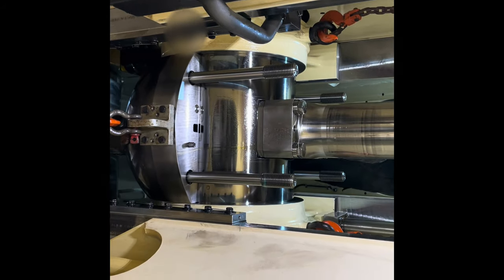Once the pin sits on the bearing, remove the piston and crosshead weight on the two outermost 2-ton chain blocks and loosen the chain blocks. Then apply some oil on the upper part of the bearing and start lowering the crosshead bearing top part using the two innermost chain blocks.